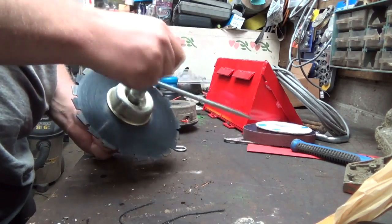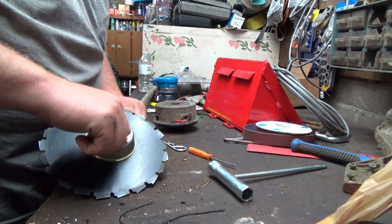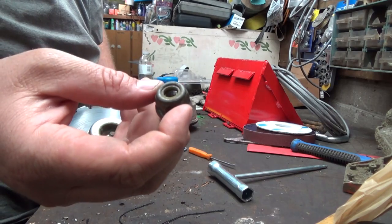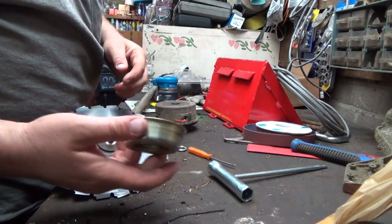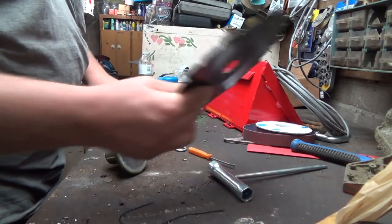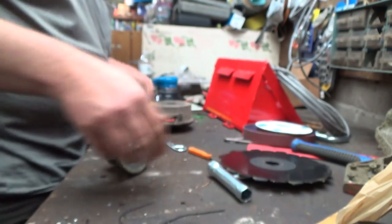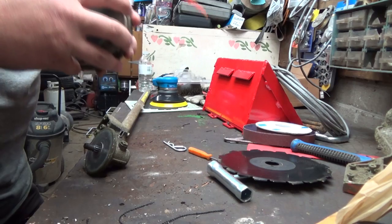There we go. Now, very important, if you do have something like these, do not lose this nut. If you go lose that nut, a special nut and everything, it's $10 for one nut from the dealer. So I got a thing I hang all this stuff on here. That little cone thing comes off, that goes on. This thing too is a little special little washer with some little gnarly things on it. Make sure you don't lose that as well, so that goes up. And then you take your blade off. There you go, and that's sharpenable. You can sharpen like a toothpick. Like, see, that one's kind of dinged there a bit and needs a bit of a sharpen. That's definitely doable. Now, I don't know what's left on here for string. Well, there's a fair bit, actually.